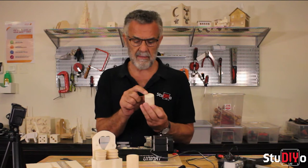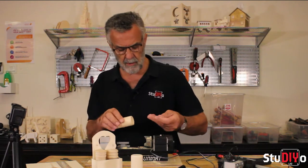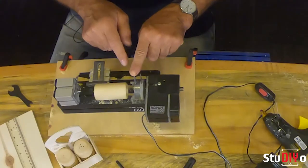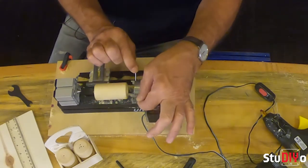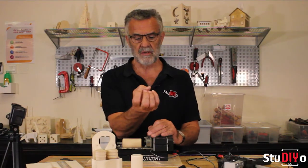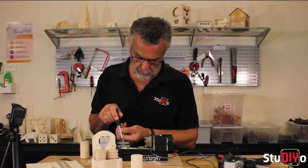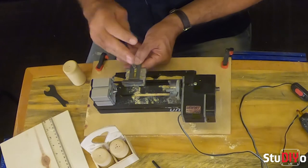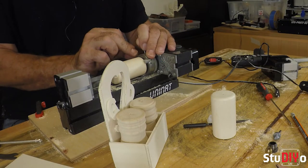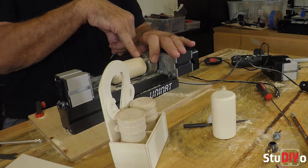The salt and pepper blanks are both the same at this point, as they've only got one hole. We take the two steel pins and open the chuck using the holes on the outside, turning them to a position where you can get two holes together. Turning in different directions, one way makes the jaws close and the other makes them open. Once I've figured that out, I slide the tool post back out of the way and lightly grip the blank — not too heavy, so the jaws don't dent the wood.